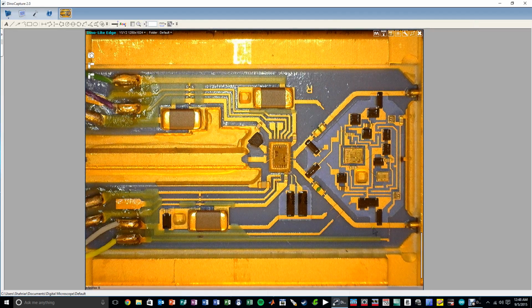Now these black spots are likely all resistors. In the center you see the main indium phosphide chip, which is the main amplifier. It's a differential in, differential out amplifier, but clearly one side of it is terminated to 50 ohms, while the other side is going through first a small piece of microstrip transmission line and then goes into a Micro-Coax, which is built into this module. Interestingly enough, it seems like they inject this blue dielectric material directly into the Micro-Coax as well, perhaps a very low loss dielectric constant material, as I was saying before, to create a very broadband, well-matched low-loss Micro-Coax line directly in the package. This is clearly something they've developed and quite expensive to produce.